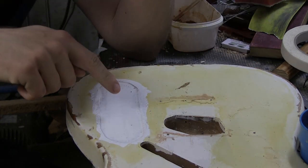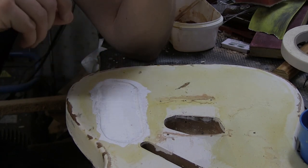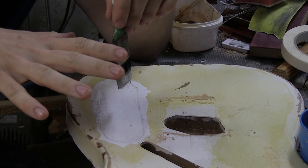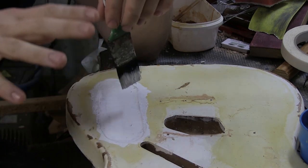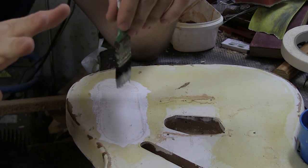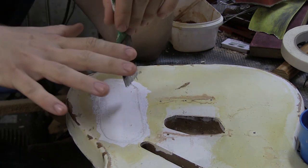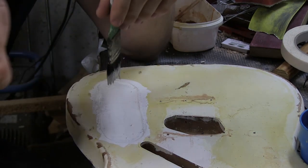You might ask yourself, well, this is very white and your guitar isn't the same color. That's because this is supposed to be an old guitar. So what happens is actually the paint doesn't yellow, it's the clear coat over that yellows. And so I've put on a yellowing clear coat. And we're still gonna have to clear coat this, so we're not over yet.